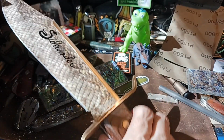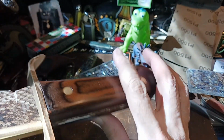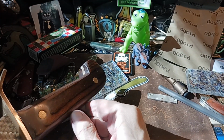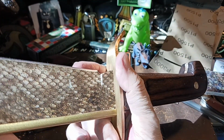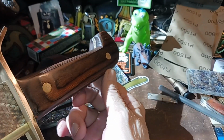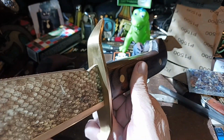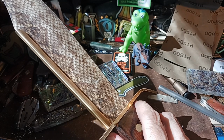And when you're doing this, be careful, because I had a naked blade, especially when you're buffing. You've got to know what you're doing with buffing. With the rotation like this, you never buff on the very top of the wheel. You want to buff on the bottom. If you don't know how to buff, watch a video or something at least before you do it, because of the speed that buffing wheel is going. You think, oh, there's nothing on it, it's just a buffer. But you've got a knife too, and you're giving it some force, and it catches it just right. Man, these things will throw knives. They can be very dangerous.